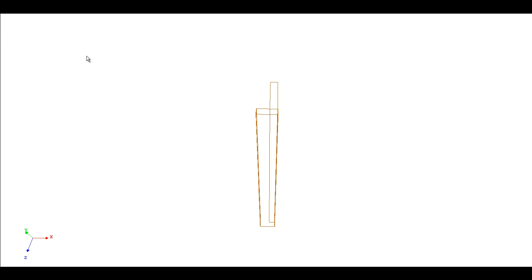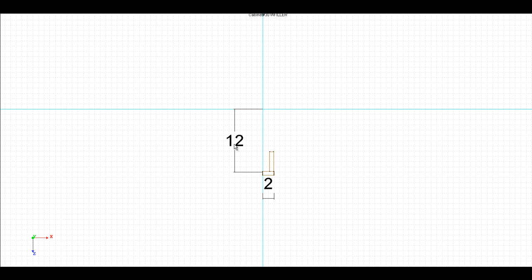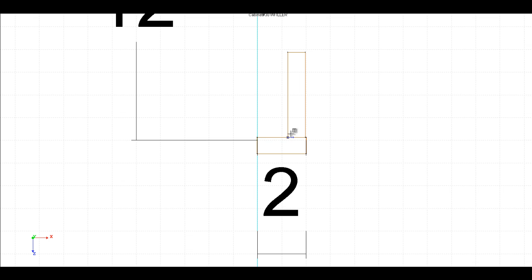A 2-inch wide filler on a 130-inch long wall is probably fine as far as your width. You might go a little bit more if you're a little afraid your measurements are off. But the idea really is just an insurance policy. The dimension from this point to here is 1.25 inches, which means you can be off by about 1.25 inches and your cabinets are still going to look professional. So 2-inch wide fillers, if you're doing base cabinets, is exactly the same way.